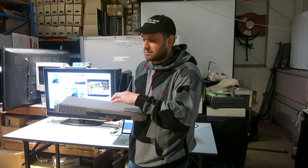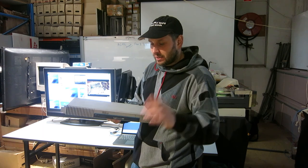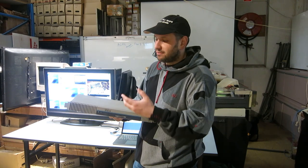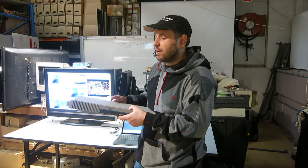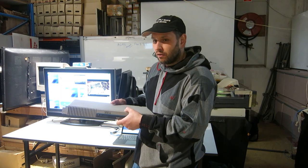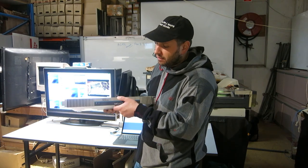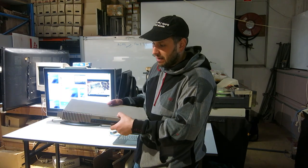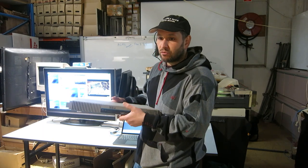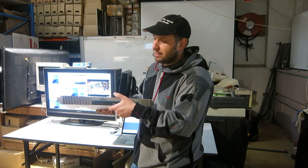What you have to do is install software on a Mac or PC. You turn on the unit, it sends the MAC address out onto the network, and a server with its MAC address listed in a BootP config responds and sends the actual package files back to the unit, which it loads into RAM. It then starts functioning as an actual unit — very different to how we do things now where software is straight on the unit. The unit will hold the software and config as long as there's a charged working battery. If the battery goes flat, it loses all config. So on my own unit here at the ACMS, I've replaced the half-AA 3.6 volt battery with three AA batteries so the config and software stay on the unit without needing a BootP server all the time.